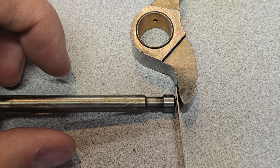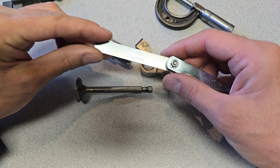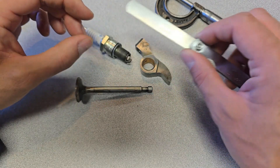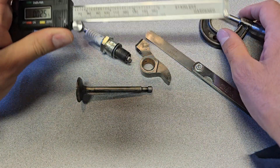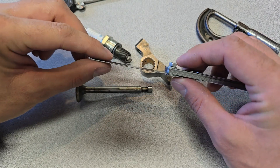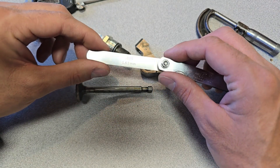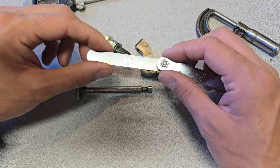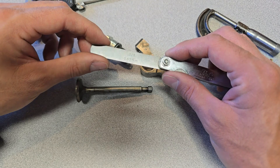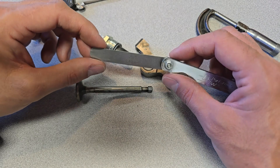The goal is performance. Whether you're setting spark plug gaps, rocker clearances, or any other clearance on the car, make sure you understand how to use a feeler gauge — it's very important. Don't make the mistake of thinking you know. Spend a few minutes and verify you understand what the gauge represents. If you don't, you'll end up with gaps that are too big. Set a wrong thrust clearance on the crankshaft or primary gear and it's too loose, and you've built an entire engine only to find too much space — a wandering crank or a noisy primary gear — and you have to take it all apart again. Learning to use these tools properly saves you a lot of time and money.